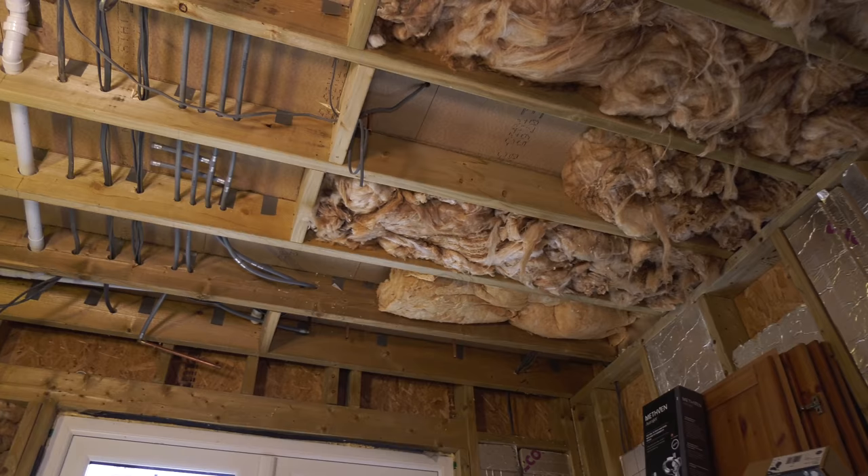That little beast is done. One thing I'd like to point out: it's a very narrow towel rail, so I've put the top brackets a little bit lower than I usually would, so you've got a chance to get a towel on. I've also set them out quite a long way from the wall so you're going to have to fold your towel to get it between those two rails. Practical things like that make it easier for the customer. I've also got two lockshields on that because I always want heated towel rails to come on regardless of what the rest of the heating system is doing.